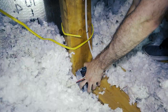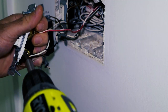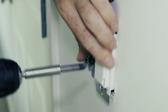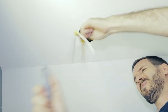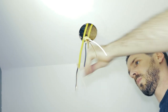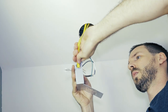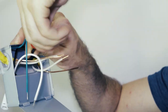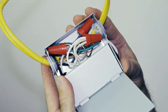In basic terms, I am taking my red light wire and connecting that to the recessed lights instead of the ceiling fan lights. This only works if the current old wire is a 12-3 wire, meaning it has three wires plus the ground — a black, red, white, and ground. At the end of the day, you can always get everything set up and then hire an electrician to do a final hookup or checkup before you switch the breaker back on. This will save you thousands of dollars, and this is what I did the very first time I ran recessed lights years ago.